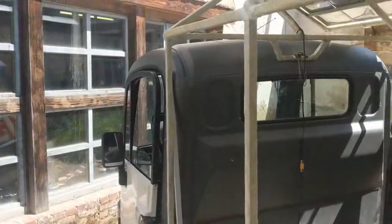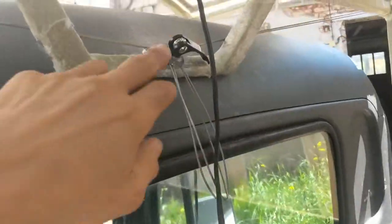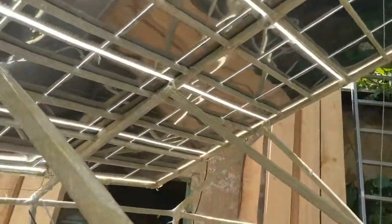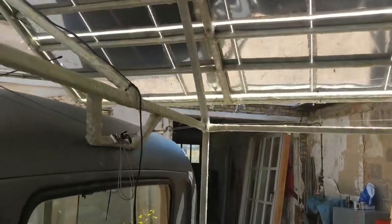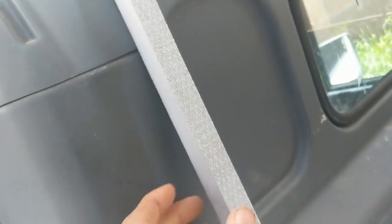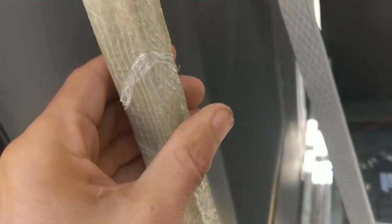This is temporary, but if you look at the door, it's quite tough and I'm quite proud of it. The solar panel can tilt 30 degrees to each side, which is especially necessary in winter times. It's made of XPS — extruded polystyrene — that's still a foam but a very tough, strong version. You can buy them two centimeters thick, 60 centimeters wide, and 125 centimeters long. With a heat wire from a toaster, I built a machine to cut them into squares. Then you need fiberglass.